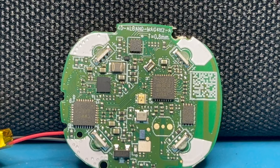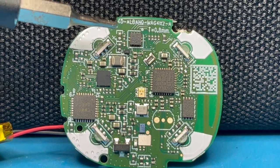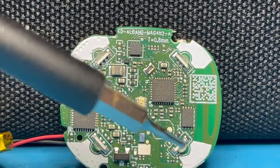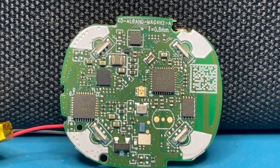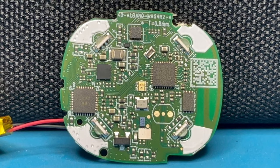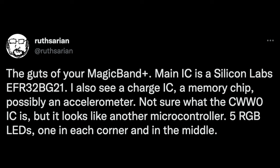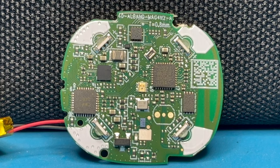This little thing right here is the RFID tag, and it makes sense it's on this side since you touch everything you want to badge into with this part of the band. Looking at the circuit board, the first thing I saw was a marking that I think is the unique identifier for this version. There are four LEDs in the corners and one in the middle — those are the sources of light during nighttime spectaculars or when you approach the statues. Not being an electronics expert, I looked up what these components were. Another hobbyist found a charge IC, a memory chip, and possibly an accelerometer. The accelerometer detects movement — your wrist waving at the statues is how it knows to play a sound. I can see chip BG21 here; its primary purpose appears to be for Bluetooth, which is likely how it interacts with the statues.